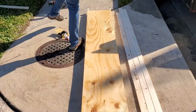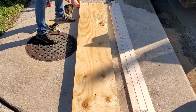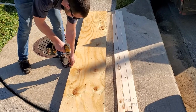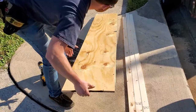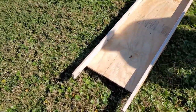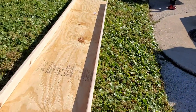So what we're doing is creating what I call sliders. This is just something that we can set the bucket of gravel or dirt on and just push it. You'll see when we get down in the crawl space how well this works. It takes a few minutes to set this up and you spend a little more money buying some plywood, but we can reuse this over and over again. We used to do this in Charlotte because there are a lot more crawl spaces there. Watch as he flips it over — you can see we just made a chute. We can set the bucket on that chute and just push it, and it'll slide eight feet no problem. Then we drop it onto the next chute and we can go all the way around the crawl space.